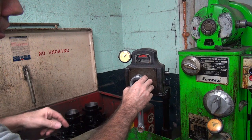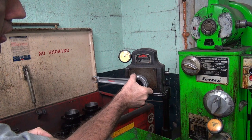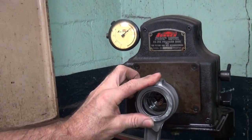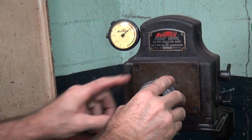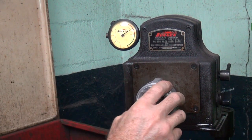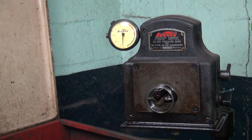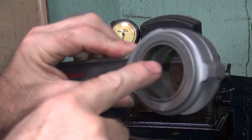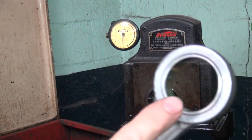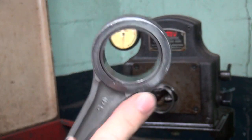Okay, so I was up around zero, around one. You got two tenths out — see how it drops down when you rotate the rod. So if you look at the needle, it goes down two tenths. It's two tenths out of round now. This one here is two tenths or a tenth under that. This side didn't move, but this side did. On the other set, this thing moved three or four tenths out of round.